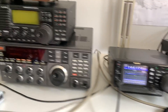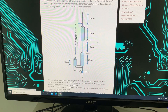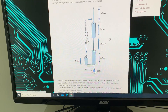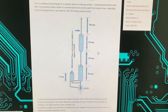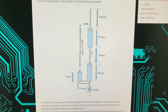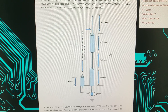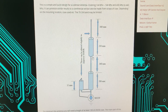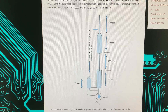For those not familiar with the coaxial collinear: you need about a meter and a half of RG-58 - the sort of coax you have lying around - and then you remove part of the shielding and expose part of the center core using these dimensions: 28.8 centimeters of coax, then 36 centimeters exposed, then 23 centimeters with shielding, then 36 centimeters without. That gives you an antenna that matches perfectly on 70cm and two meters.